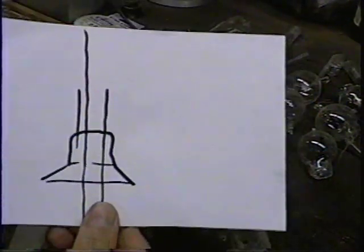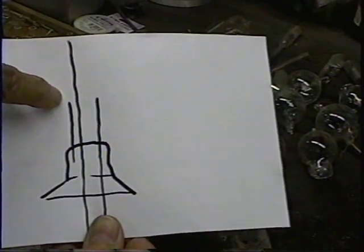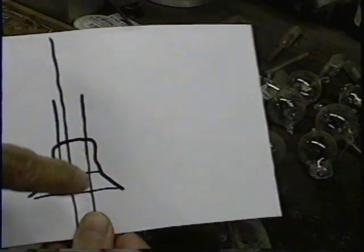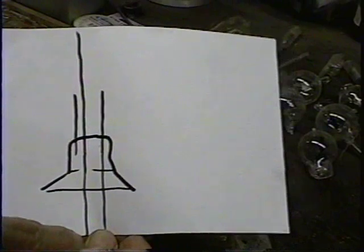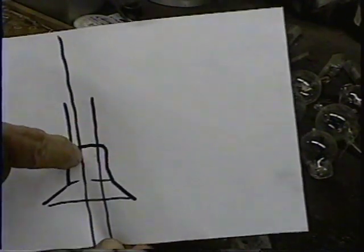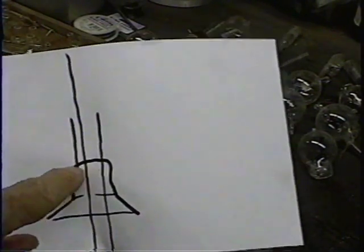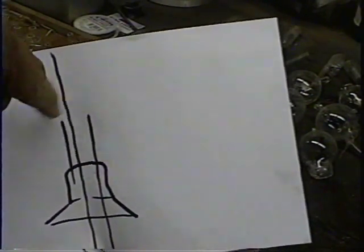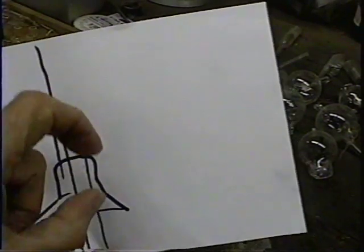To make our elements — this is what the base is going to look like. We have our flare, wire for supporting the plate, and one plate wire that has to come out through the bottom, so we'll have a feed-through on it. Then we'll have a feed-through for the grid, and the grid wire has to be long enough to make the actual grid. We're not going to put a joint between the zigzag and the feed-through into the glass — we'll use the same piece of wire. So the grid wire will be very long and the two plate wires shorter, with a feed-through on each.